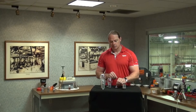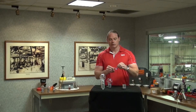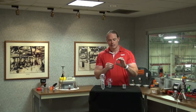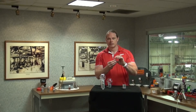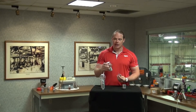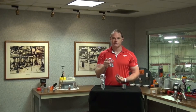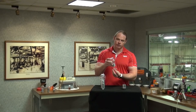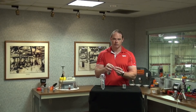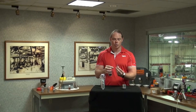To begin, open your Optomatic Oiler and take the level adjuster assembly — there are two wing nuts on here. Be sure to set your wing nuts together tightly at the level at which you would like to set the oil level in your bearing housing. The upper casting and bottle assembly of the Optomatic Oiler is going to rest on this level adjuster assembly. The two wing nuts tighten together in order to hold the position at that point.